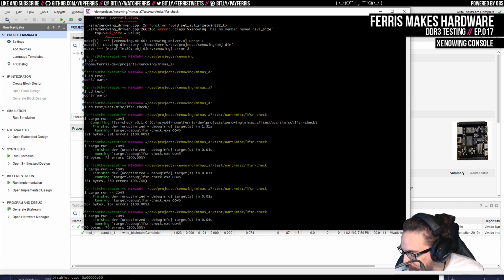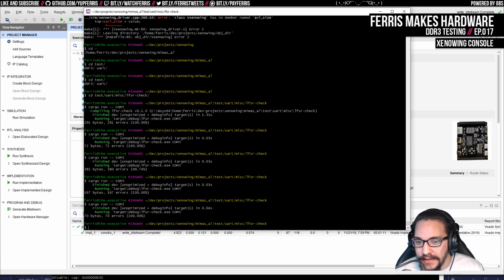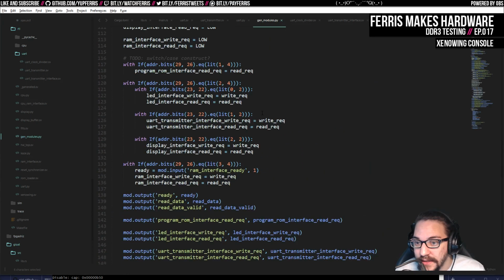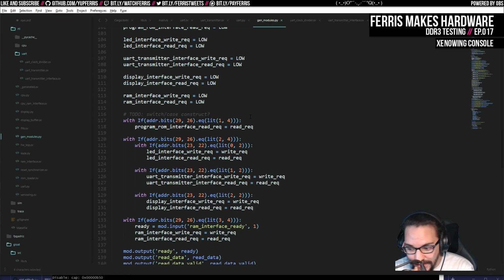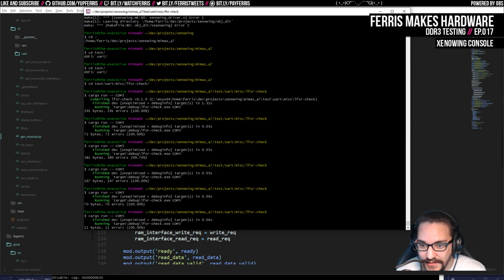Maybe we could try to get some insight from looking at the data that actually comes out of it versus what we expect. In fact, that might be a good idea, because then at least we can start seeing if it's something really obvious. Like if it's always outputting 1 or something, which I don't think it will be. I think it's going to be not that dumb. Also, these numbers seem like they're fine for UART packets, small amounts of packets. Nothing really stands out there. I mean, it is also interesting that we're getting some data out of this. So it's clearly talking to the UART somehow, and we're getting data consistently. So I don't know if it's the receiver or the FTDI chip that I'm using. I don't really know.